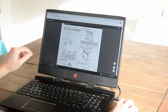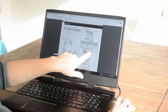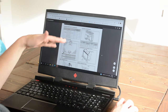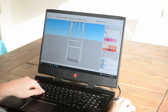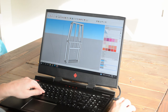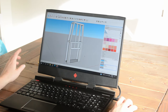These are my framing dimensions, and instead of doing just a flat straight wall, I'm going to do a taper. So I got my rough opening and clearance to combustible set here. I'm just reading it out of the requirements for this unit. And I drew it up in SketchUp so that I have a clear idea of where I'm going here. So I've got it all drawn up, dimensions figured out, and my rough opening to fit the unit that I'm going to be installing, and I'm going to go get started.